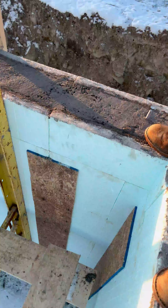On the inside, we've installed some plywood on what we call either common joints or areas of added stress — where we could have potential movement when it pours. We need to brace those because with anything being poured with that much concrete, there's a lot of force as it moves in and around those corners, and we want to retain that as much as possible.